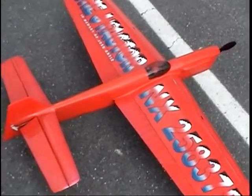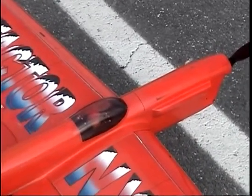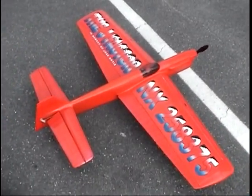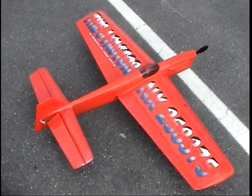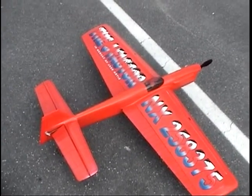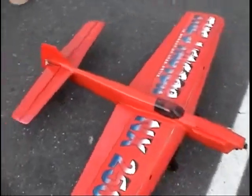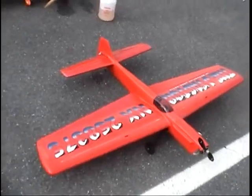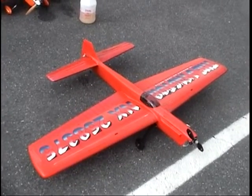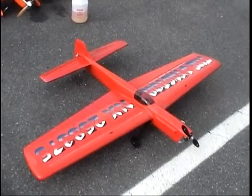Now today, one of the things we want to test, let's put a muffler pressure fitting on Brian's little muffler, what we call the lawn chair muffler. It's actually all made from lawn chair parts that he had in a dumpster. I don't know how much we could sell them for, that's the problem, if they're all lawn chair parts. But anyway, we'll have the choice of trying muffler pressure or no muffler pressure, something we haven't been able to do before. And we have a 274 and a 248 Venturi. So far the 248 has been much friendlier, and we certainly don't need more power. We can even choke it down a little bit more with the pantyhose if we need to.